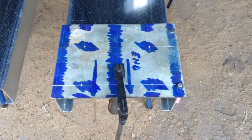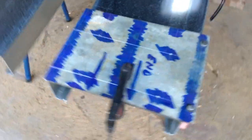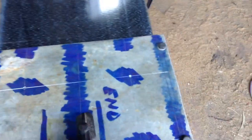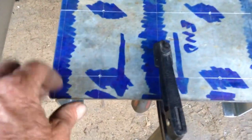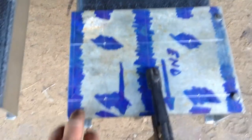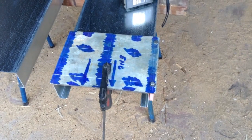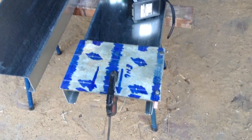We come down to the other end. What we have to do now is drill the mounting holes for the base plates that we already have in the concrete slab. It's just a simple fixture I've made up — it has a fence along the bottom, clamps down, the fence holds it all square, and we just bring it flush with the end. Then we just pilot drill our four holes, and then we'll run a quarter-inch drill bit through — probably do it with a rotary broach or something like that.